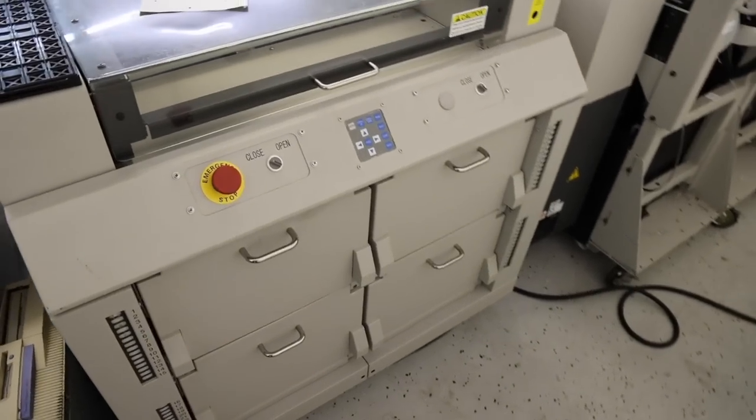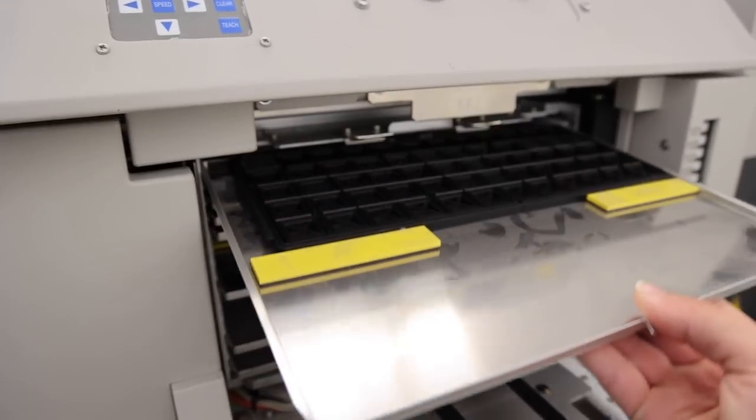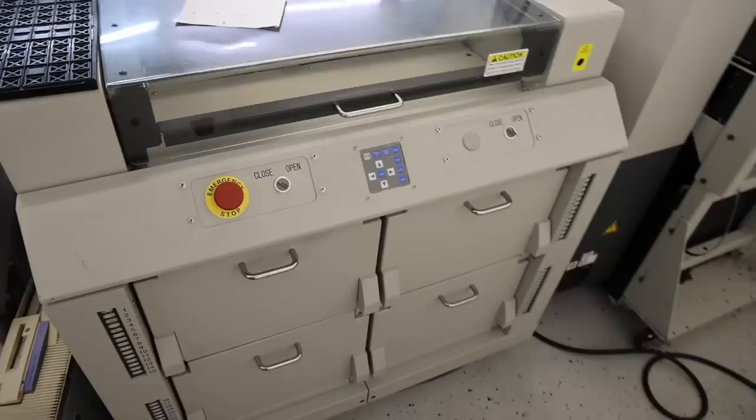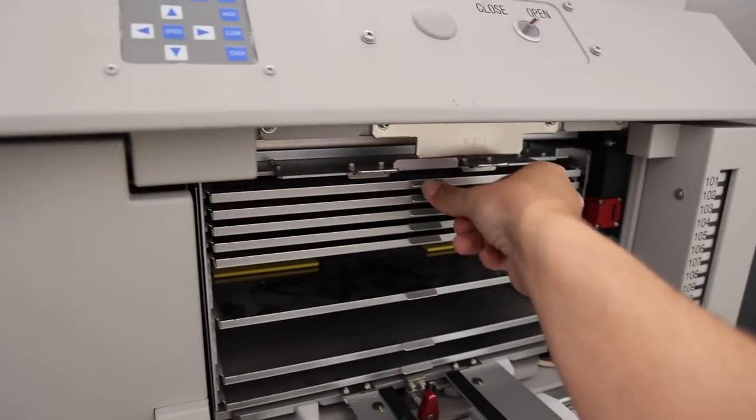It's also got a double shuttle chip sequencer, so you can load 16 matrix trays into the unit next to the machine and it'll sequence those chips into the machine as they're needed. A chip sequencer is an entire machine that just acts as a feeder for parts that come in trays — it's a cabinet you fill with a whole bunch of trays of parts. There's a tiny pick and place inside that picks parts out of the trays, puts them on a little conveyor belt, and that conveyor brings the part into the pick and place to be picked. It's a big mega feeder for tray parts. It's so cool.